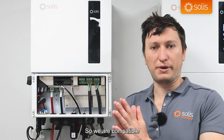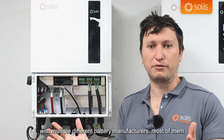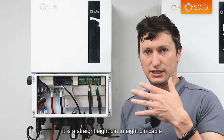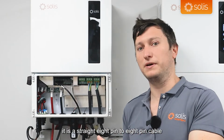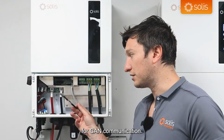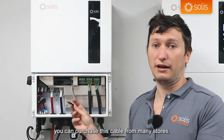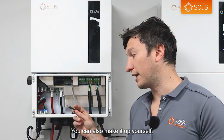Generally, we are compatible with multiple different battery manufacturers. Most of them, it is a straight 8-pin to 8-pin cable for CAN communications. So you can purchase this cable from many stores. You can also make it up yourself.